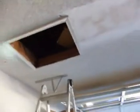Okay, well, this attic is okay. However, the attic doesn't have a proper hatch, and it should, because it should be sealed so that fumes and exhaust from the car don't get into the attic. Now, normally this is a major call out because the attic is attached to the house, but in this case the attic is sealed from the house. But I'm still going to ask for a proper attic door with a weather seal on it to be fitted, just to cover us and make sure it is safe.